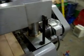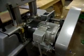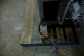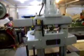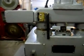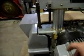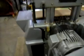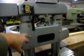If you come around, here is the wood thickness gauge on the side, and the motor and feed unit, the bright shiny new wheel cover. Down here is the electrical box. In there I've just got a wire poked in there for temporary hookup. On the top here you can see this is the head raising and lowering motor. These are the limit switches, top limit and bottom limit, so that you can't overrun the head up or down. If you notice on these, this is a pretty serious bit of casting.